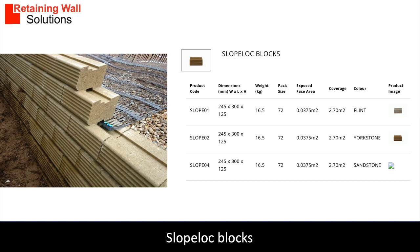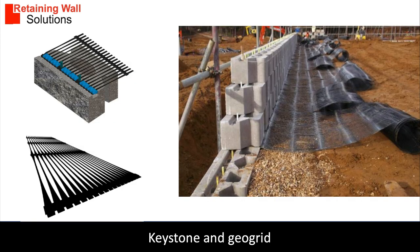The design principles are similar to keystone. Keystone and slope lock soil reinforcement walls are constructed in a similar way, and we have an installation manual that describes the full process. The image on this page shows the geo grid being laid out before being covered in soil, and you can also see how the geo grid connects to the keystone block using pegs.